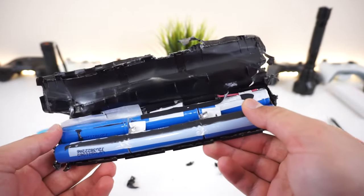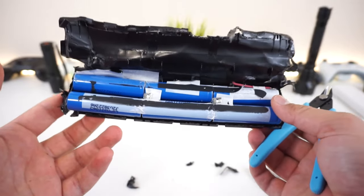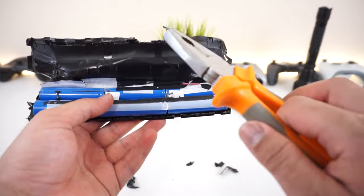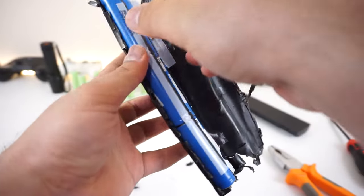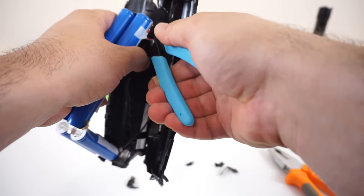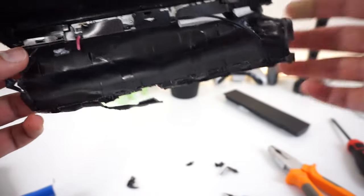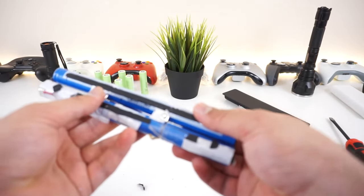You're probably thinking this is a complete mess and pretty dangerous — well, it kind of is, but if you know what you're doing you should be fine. I don't want to use an X-Acto blade to slowly break the shell apart — the plier method saves time, is less stressful, and much easier to get into. At this point we have pretty much all the batteries exposed. You want to first cut off the main terminals to the board. The batteries in your smartphone, laptops, and tablets all have a circuit board for safety features to prevent the battery from blowing up or overcharging, but since the laptop isn't being used anymore, you don't need that. So now take the batteries out safely.